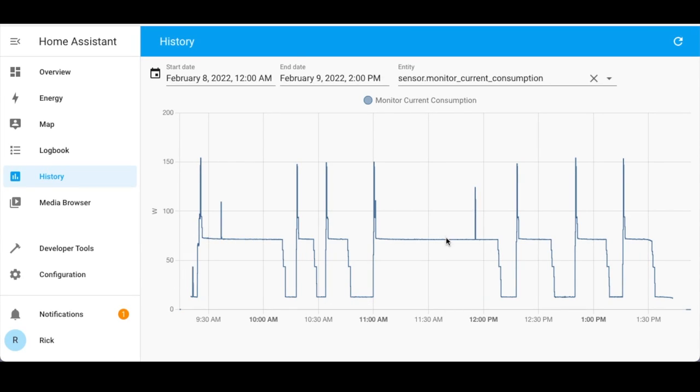When it was running it settled at about 70 to 71 watts at around 35 percent furnace capacity. It was about 40 degrees Fahrenheit outside today, so not a super cold day. This is just a use case example — it won't be applicable to everyone since people have different furnace efficiencies, insulation levels, and weather. I'm just showing what this battery can potentially do. Those spikes up to 150 watts every once in a while were likely the condensate pump running.